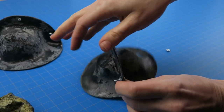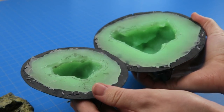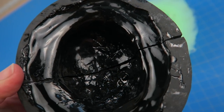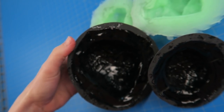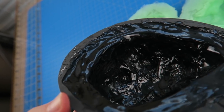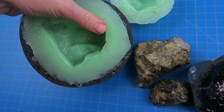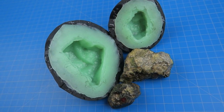I could trim up the silicone a bit around the edges but it fits so nicely with the rigid portion that I just left it exactly as is. The epoxy and fiberglass keep everything nice and in place. There is a bit of a wider crack in the jacket than I'd have liked because I had to chip away the excess, but that's fine for this type of mold with the silicone insert. Something to do more precisely if you're working on a more precise project or a mold without a silicone insert — that seam would need to be perfect because anything there will show up in your final casting. The silicone didn't stick at all — it's fantastic and so easy to work with when casting. There's no worry of accidentally ruining your original, which is great if you're casting something where the original is important.